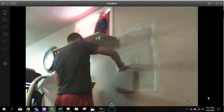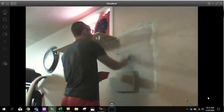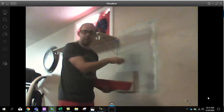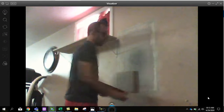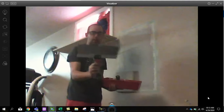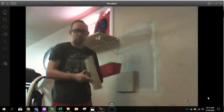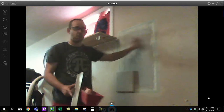This is what I do all the way around. Once the first layer is done, I'm going to let this dry for a few hours. When it's dry to the touch it'll change color and turn chalky white, then you can come back and hit it with another layer. Where this inner section is sunken in more than the outer layer, I'm going to pull outward with my mud and come down along the edge the long way to make sure it doesn't show up as a divot. I'm going to use a much wider knife — this is going to make it so smooth and blended in that you won't be able to see the difference. I'm going to apply a ton of mud to this section to make it nice, smooth, and consistent.